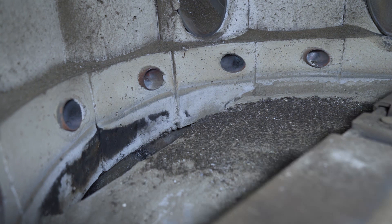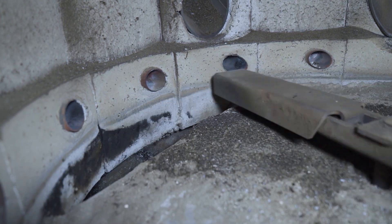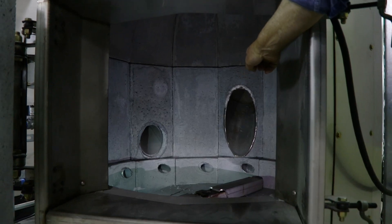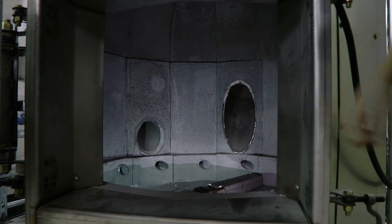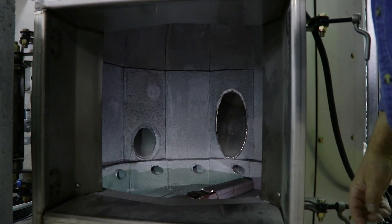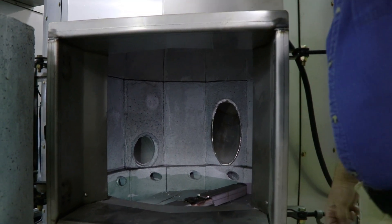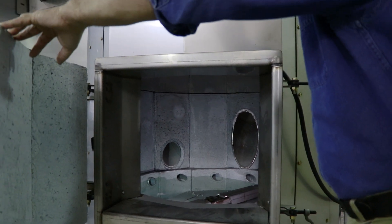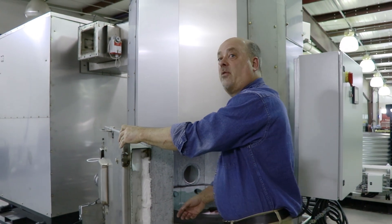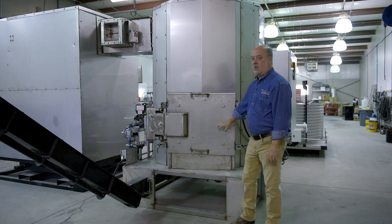There is a pit on the left side where we pull out the ash or biochar. The arms are considered sacrificial and removable — you simply lift them out and put new ones in. On the far side, the larger tube is where the biomass falls in. On the left side is where we have a gas igniter that we use to light the system initially, which takes about five minutes, or it can be used as a gas backup system up to 1.2 million BTUs input. A good burning system like this starts with a high quality and high efficiency combustion chamber, and that's what we have here.